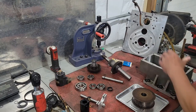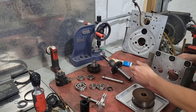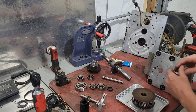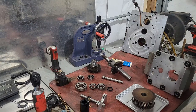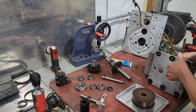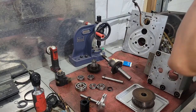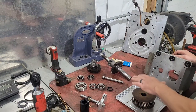There are retaining clips for the bearings on the upper side. On the bottom side, this main shaft protrudes through here and this cog gear is a tolerance fit to it — there's no keyway, it's not tapered, it's a straight bore tolerance fit. You can press it off, giving it a little bit of heat to make it easier, and it won't damage it if you press it correctly — straight up and down, even pressure, properly supported. We had about a quarter inch left to press it off the shaft and it still took quite a bit of force.